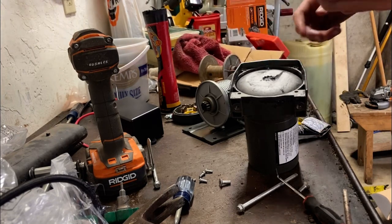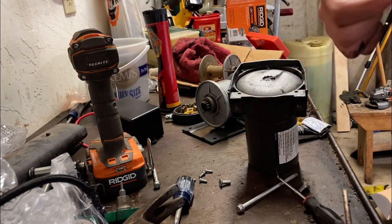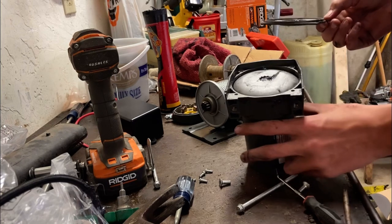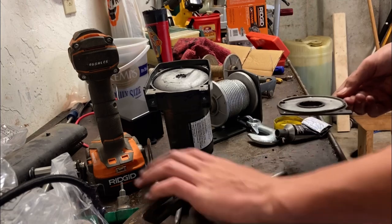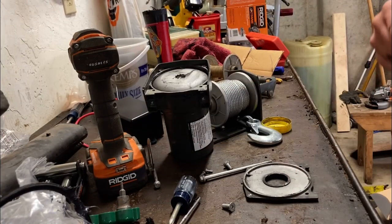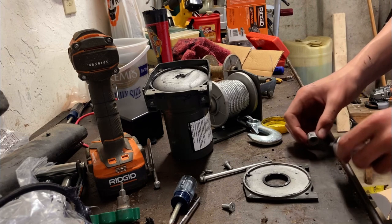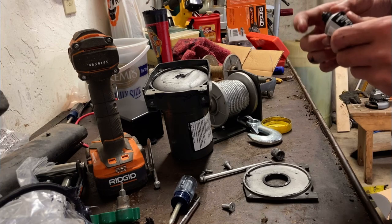Okay, got all the grease off here. So now you kind of look at it, eyeball it, and realize, yep, grease sits on there like so. So now we're going to put gasket maker on. I just want to line this outside here, kind of get on the screw holes and everything, because I don't want any water getting in here.